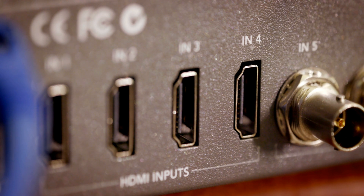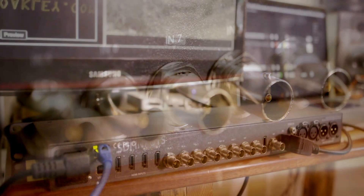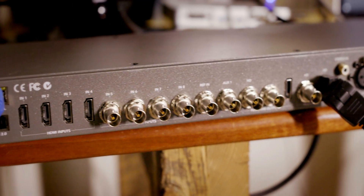One thing I really liked about this unit was the mix of inputs, particularly the HDMI ones. While I don't work with a lot of consumer cameras outside of maybe a GoPro or two, I do work with a lot of laptops for PowerPoint or other presentations, and it's easy to directly connect those into one of the inputs. None of the inputs require a time-based corrector — everything has its own frame buffer for direct input. However, you have to match the frame rate and frame size identically across all devices. None of the ATEM units have the ability to scale a video frame or convert frame rates on the inputs.